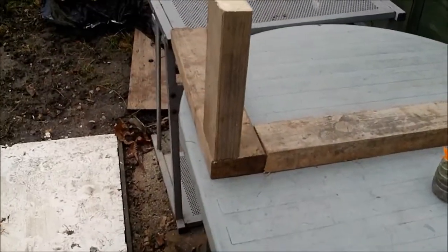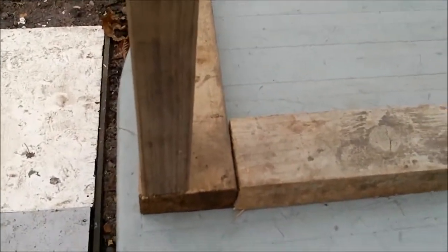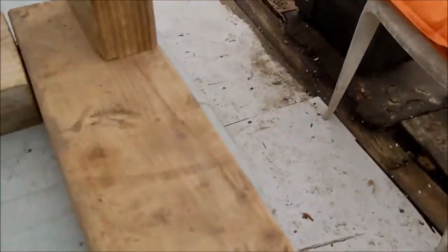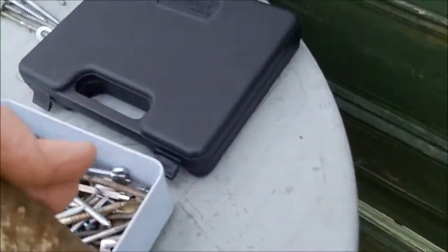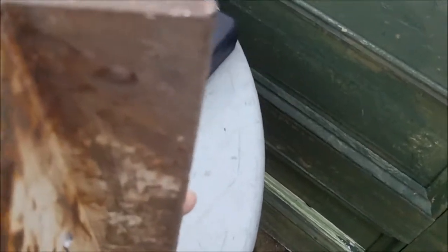To clarify where the problem is — it's in this area here. I will be using those blocks there, which are properly cut down, to put them into place. This is the horizontal across the long ways, this is the post — they're all two-by-fours. The solution I've come up with is an angular piece of iron, six mil, 45 degrees on each side, all equal. I have cut it 16 inches and I'll place it down here for you.